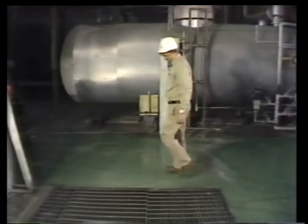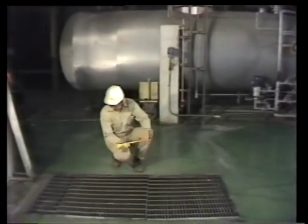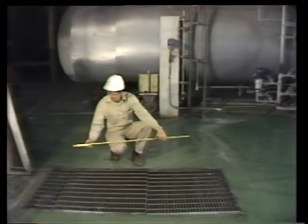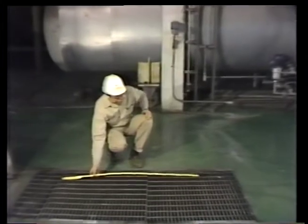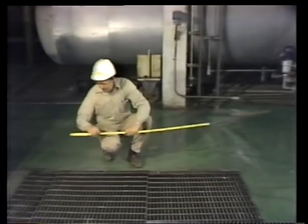The last thing he has to measure is the shaft clearance. The load will have to fit through the shaftway without banging against any of the sides. First, he measures the length of the shaft. It's more than long enough for the load. There'll be about a foot on either side.